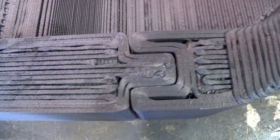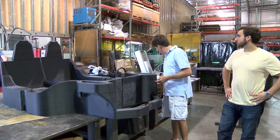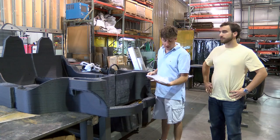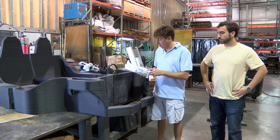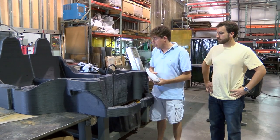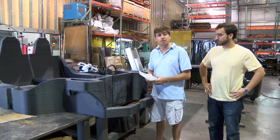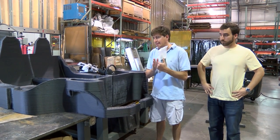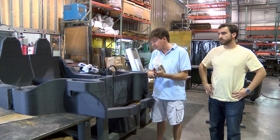The joint is going to be mechanical. It's going to have a mechanical attachment with a grade four 5/16 bolt and also it's going to be bonded by structural adhesive. It's a urethane base that is really nice for this kind of job because it has the property to absorb energy and impact, and also when the fitting is not that tight, it's a proper structural adhesive for that.